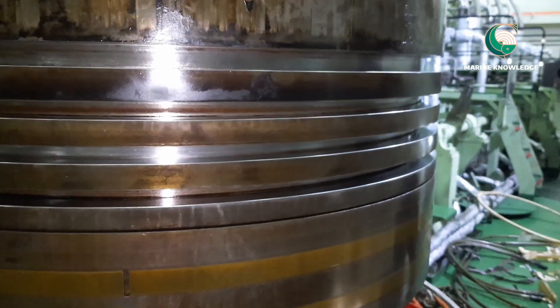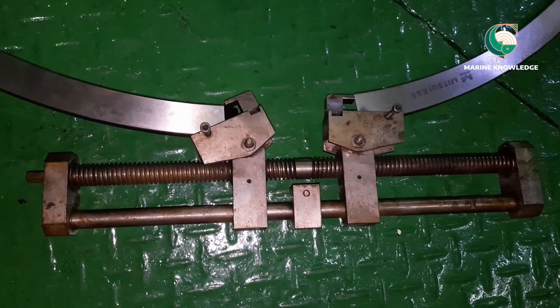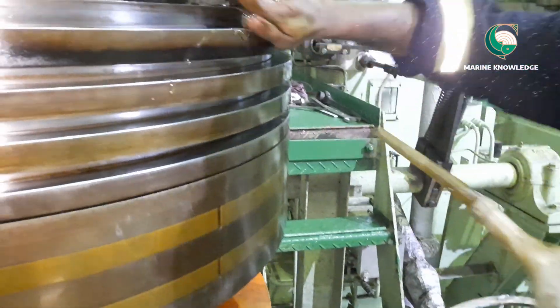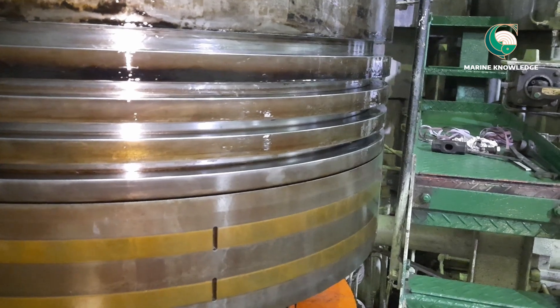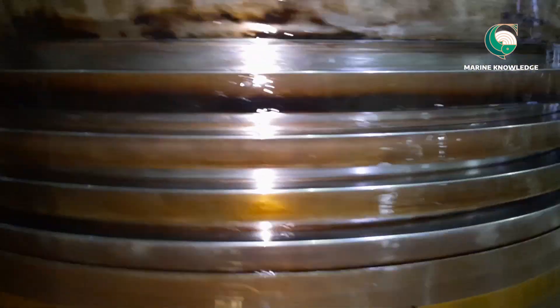This is the piston which is already ready to use. The stuffing box is already boxed up and in place. In my next video I will show how to overhaul the stuffing box. Now, before installing the piston ring, you have to lubricate the piston ring groove area and ensure the grooves are fully cleaned — no carbon deposits should be there. The grooves are completely clean, no impurities, no carbon deposits — it is crystal clean.